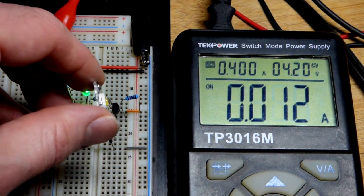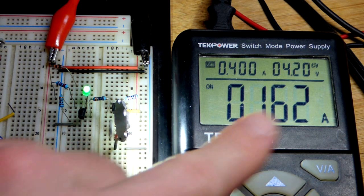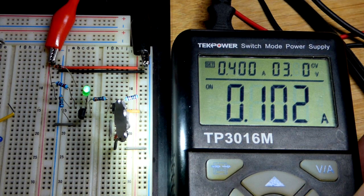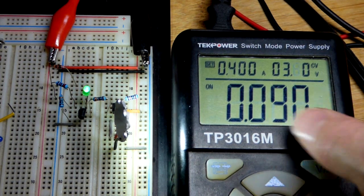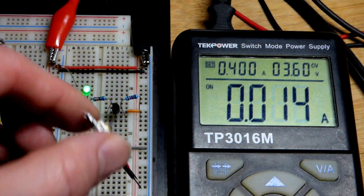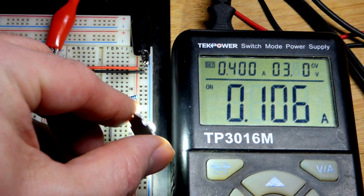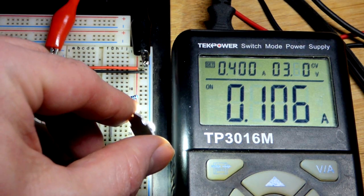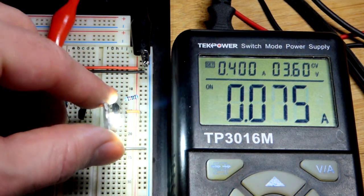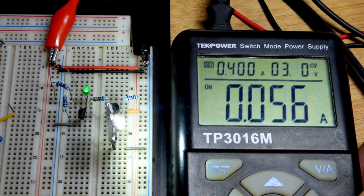You can see 179, 180 here — it's about 160, so it goes up a little bit as it warms up. The main thing with this circuit is as we lower voltage, current goes down because there's less voltage across here. We had about 97 there, and with the two together the voltage isn't being dropped from the load, so it's about 10 milliamps higher. The transistor is dropping about 10 milliamps of current through the load regardless of voltage.